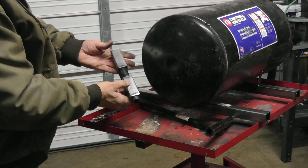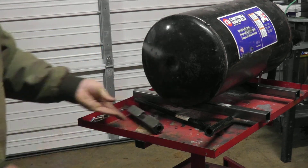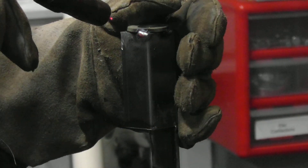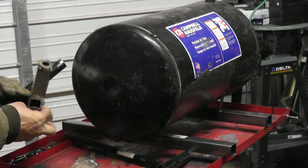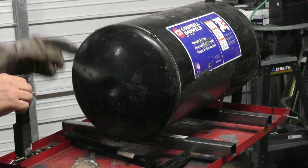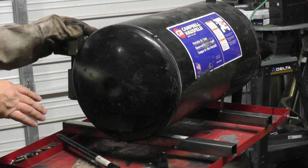Okay, so now all we have to do is keep this pin from going all the way to the bottom. I'm going to weld on a washer right there — it should provide a smooth surface so it will allow it to smoothly turn. So there it is welded to the bottom; the pin slides in with great rotation. I think that will work. The reason I went with square stock instead of the three-quarter inch pipe and metal stock was because there's more surface area to weld with the square stock, so I've got a big flat piece here — I think it will be a better hold.